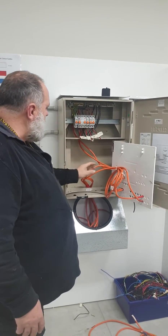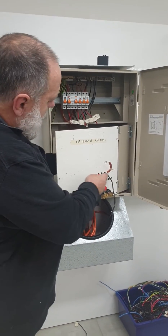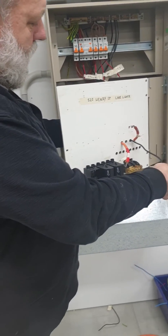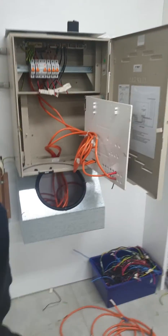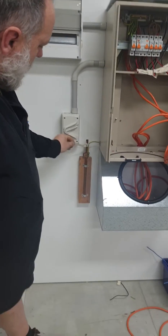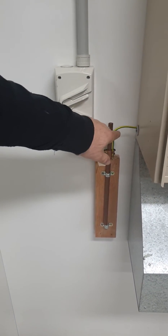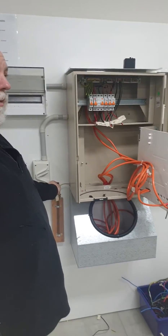We need to make sure these are cable tied. They get cable tied behind where the meter gets mounted, and from there we also have a four or six mil neutral coming up for the meter. The service fuse goes in. Other things we've got to make sure of: we have a label on the main earth, and we also have a cable tie to secure the cable so it can't be pulled off. These are the things we need to have a look at in the LUT.